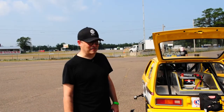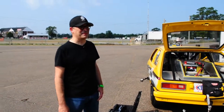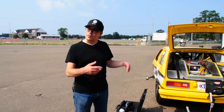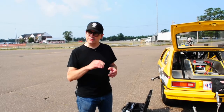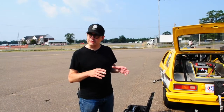His team is a lot of people we know. We need to test this thing without blowing it up again — we can generally blow it up, but today we're trying not to. We got both motors burned in really well. The idea is to get the brushes seated really well. They're DC motors, so they've got brushes on all sides — there are eight brushes on each motor, and they come in from the sides.